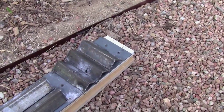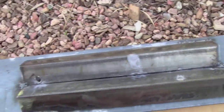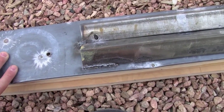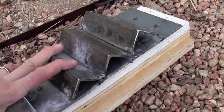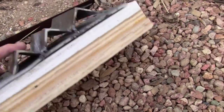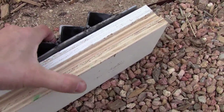To adequately test the strength of the door, I put together a sample to mimic the design of the door itself. The quality of the welds are not nearly as good — it was actually quickly tacked together — and the design is a little bit different. What we've got in the sample is the angle, then the steel, then the ply, whereas in the actual door it goes angle, ply, steel.